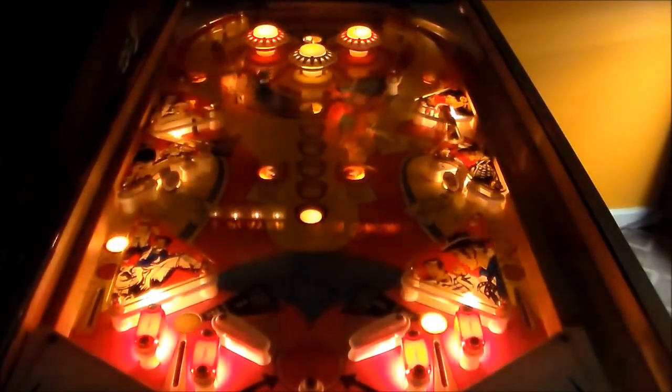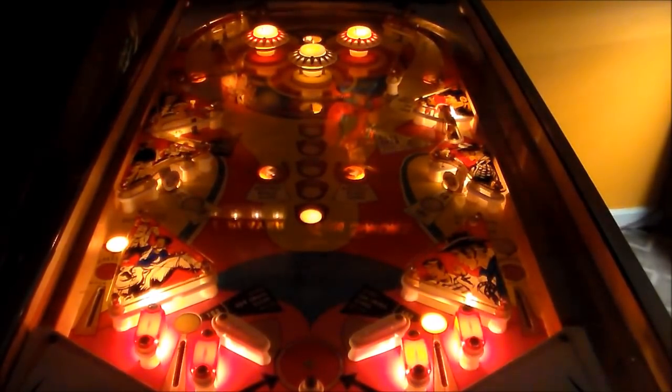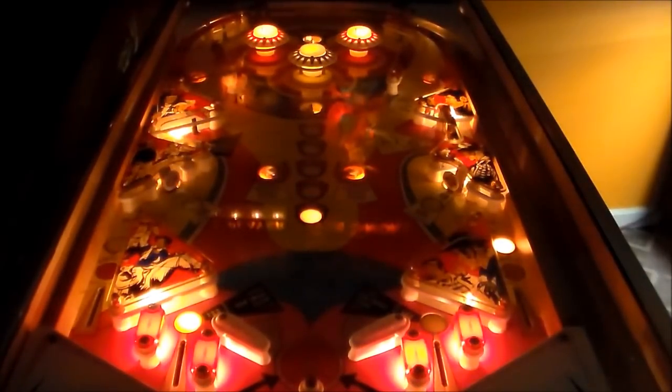The flippers are actually pretty good on this thing. Even though they're those little ones, they're amazingly strong. If you watch the repair videos, remember I found that thing where you could put it on weak or strong? I put it on strong — holy crap. If you've got a Chicago Coin, go look on the schematics. It's just a little jumper inside, you just move it. You don't have to solder it or anything. The Gunsmoke score was going off — I don't know if you could tell.